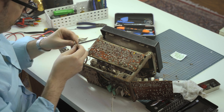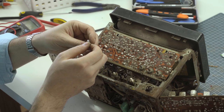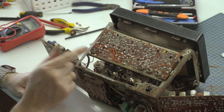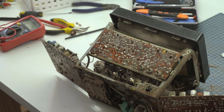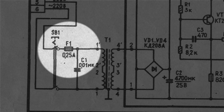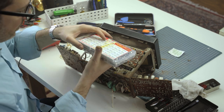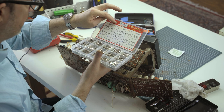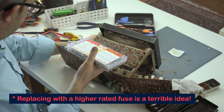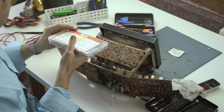The question is what kind of fuse. The only one I could find on the schematics was a 0.25-amp fuse. I have one in my fuse kit: 0.25A, 250 volts. If for some reason that pops, maybe we'll go to a higher one. It seems kind of low at 0.25 amps, but what do I know?